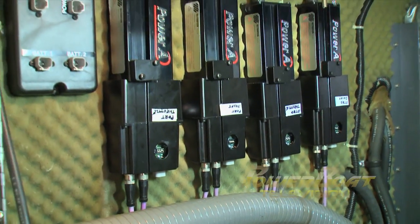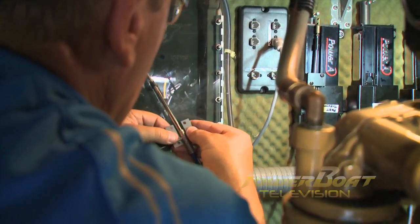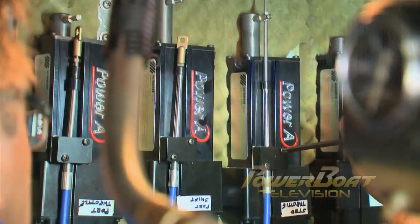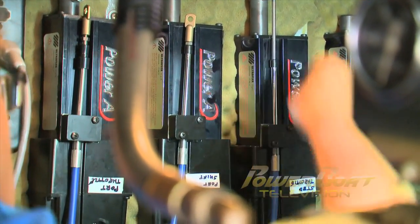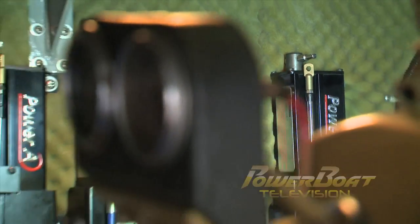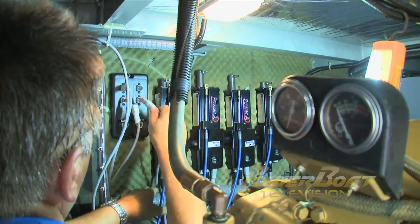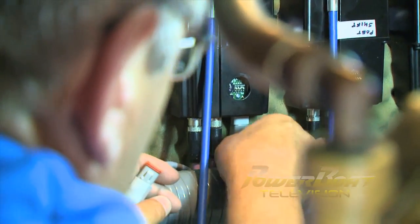The last unit required a network terminator. Since I was working with the actuators, the next task was to secure the uFlex control cables into the fixing system on the correct port and starboard shift and throttle actuators using the supplied plates, clamp, and screws. As each was completed, the cable terminal was also threaded into place.